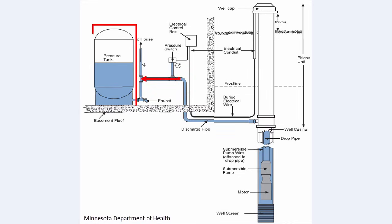Once in the house, the water goes into the pressure tank. Or, if it's a period of heavy water use that kicked on your pump, the water goes straight into the line to your faucets, shower, or dishwasher. The pressure tank stores water and also creates the pressure in the system that allows water to flow when you open up a faucet or turn on the shower.